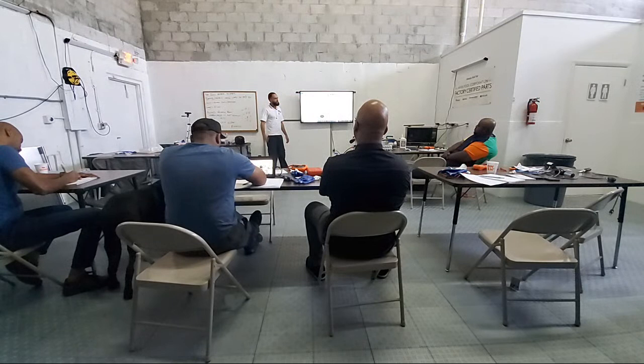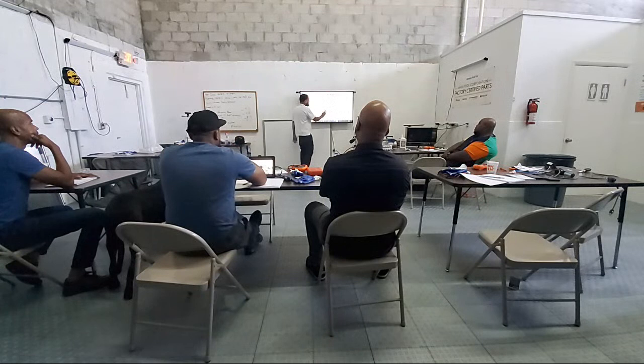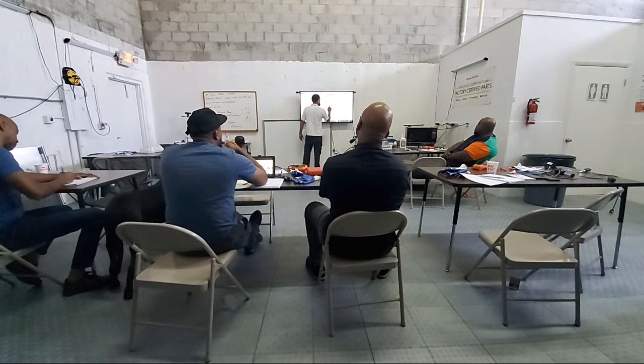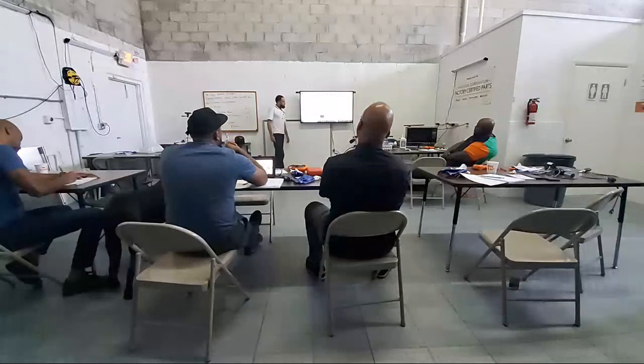An easy way to flush the entire system: remove the filter dryer completely. Cut it out. Take it out. And now guess what happens? You never want to flush through the dryer. We took the filter dryer out. That's what our system is going to look like.